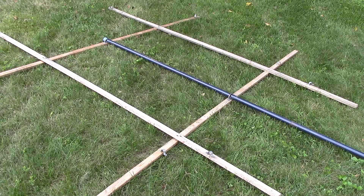These loop antennas have an aperture, or an effective pickup area, turning the electromagnetic waves into voltages we can pick up and send to our receiver. The larger the loop, the more pickup — the larger the aperture of the antenna. Will it have as much gain as a dipole? Probably not. By definition, a dipole is a resonant antenna unless it's shortened. A full-sized dipole will generally have more gain than any loop antenna below resonant frequency. Of course, if we add elements, we get directivity and gain and can beat the gain of a dipole — but we're just talking about a simple loop antenna here.